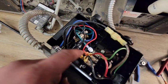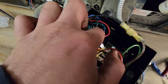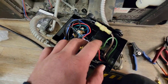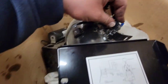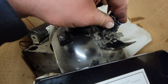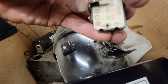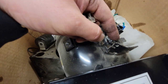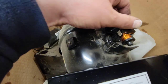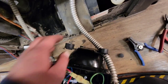This guy's wired up — red to red, black to black, ground to ground. Move this one from up there to down there and make it a little cleaner. So you have this protector on the common, which is that pin right here. Then you have the start relay — start right there, start right there — you can just make out the labeling on the side: start, run. Put the start relay on there like so, and those pins go to the winding inside the compressor.